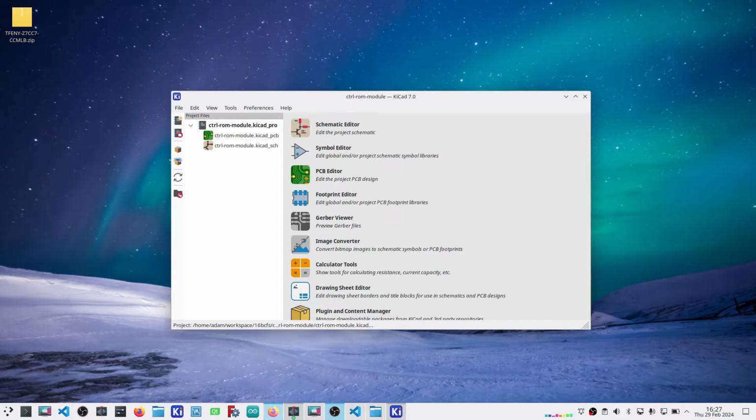Okay, the next thing for today is going to be to work on the schematic for the Control ROM module. Now, this is one of the actual modules themselves that have the EEPROM, the SRAM, the shifter, and latch associated with it so that I can turn around and get data off the EEPROM into the SRAM and then do a lookup on that and latch that for a clock cycle. Like I did before, I'm going to use the code as the basis for this, and I'm going to lay all of this out and make all of the appropriate connections. I've already gone through and checked all the symbols to make sure that all of my components are represented and they're there, so that's a good thing. So with that, let me get right into one of these smaller EEPROM modules.